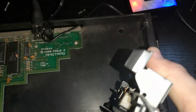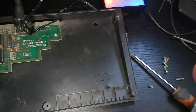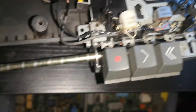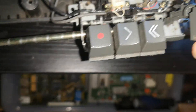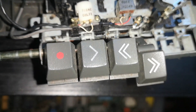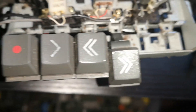To change the buttons it's very simple — they're identical on both models. You just undo the little bar by taking off the circlip on the other side, then pull the keys out and swap them over. Each key slides on one by one; you just put them in the notch here, then slide the bar through the next one, and the next one, until you've got all of the keys in play.